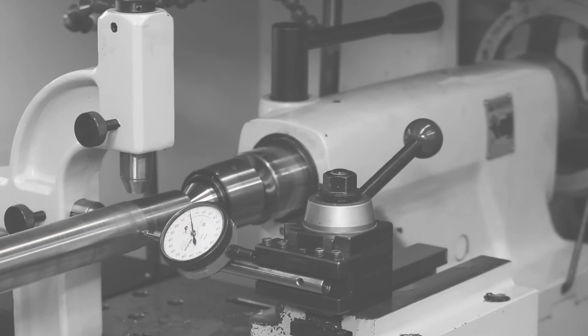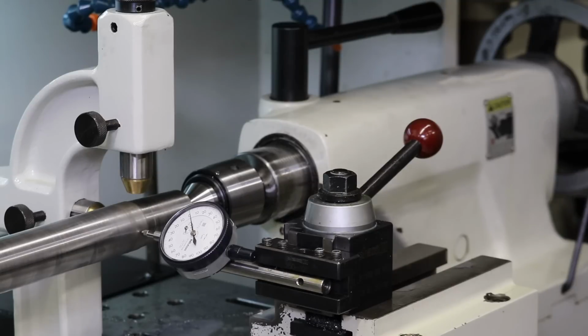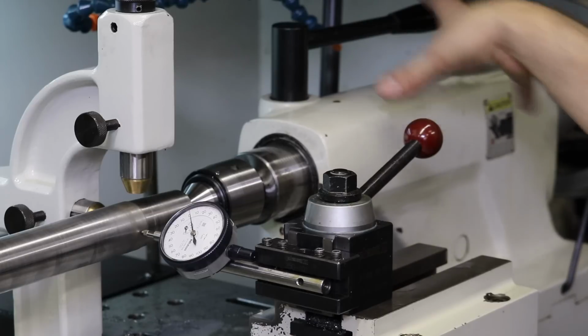And the shaft, I think, was actually flexing the tailstock and the live center and maybe the lathe bed a little bit. And now with this episode, when we added the follow rest, I have to move the tailstock back to the original position. Now with this hex key back here, and I showed this on the last episode, you can slide your tailstock back and forth.